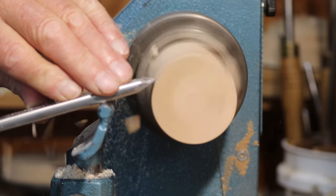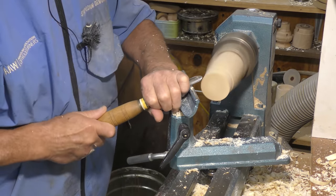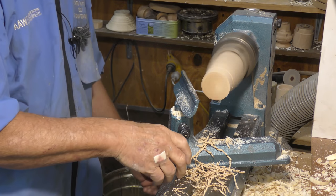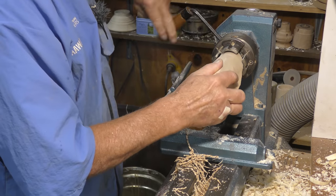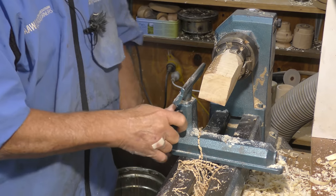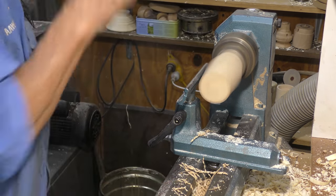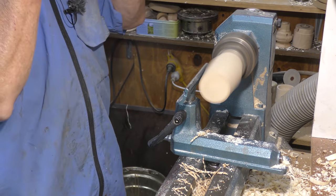It really pays in this situation for the peeling cut. I'm going to turn up the end and reverse — I was going to leave this just square in the chuck but it'll be safer. So that's a half inch skew doing the end, and we'll just turn this round — it should have a better grip then. It's not going all the way back into the chuck; I've got a little shoulder which the jaws can go up against. Now running at probably more about 1800 RPM. I should have my other glasses on — I've got readers set up for the lathe.